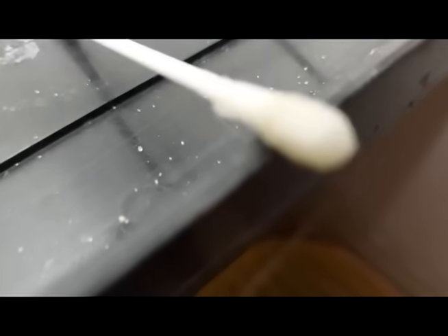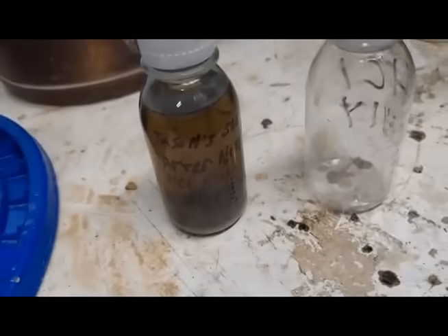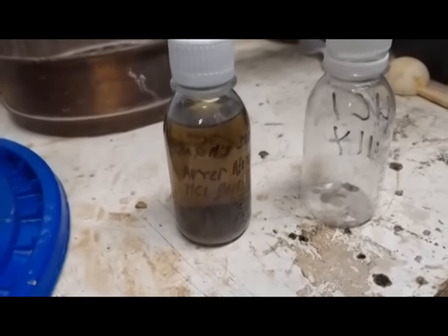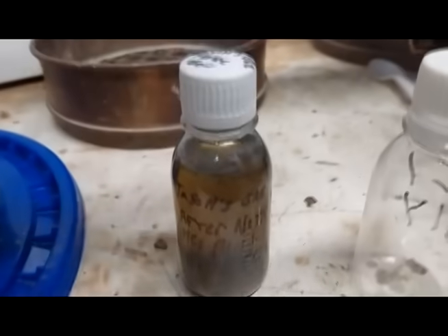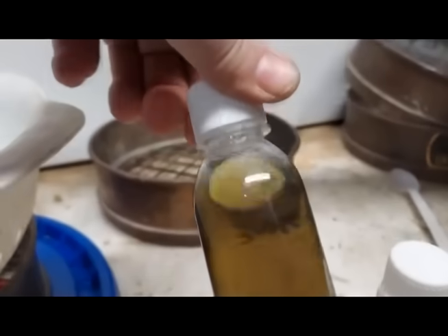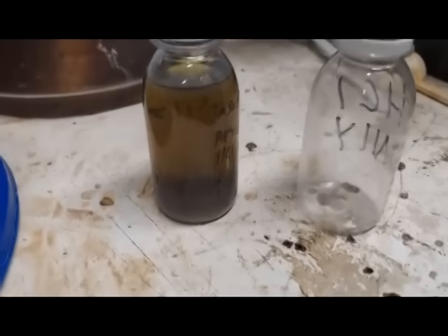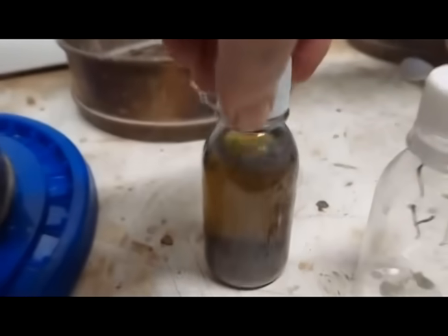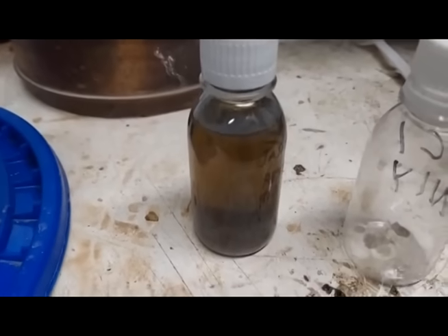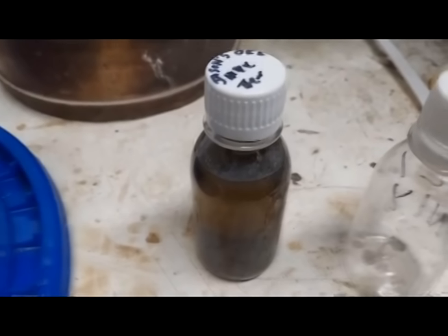All in all it's pretty clean material except this right here looks a little purple on the edges and that looks a little blue. We're going to take the material that went through the hydrochloric and whatever this was — results were inconclusive. There's such little nitric in this that if there were precious metals they've fallen out of solution. So we're going to take the material at the bottom and stick it in a cupel, with some lead collector metal, and see if we have a little metal bead.